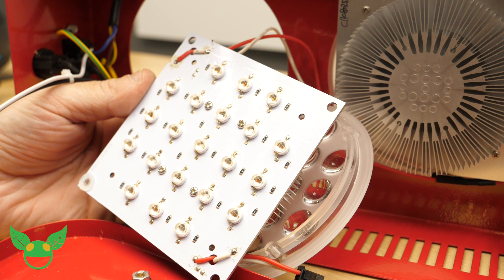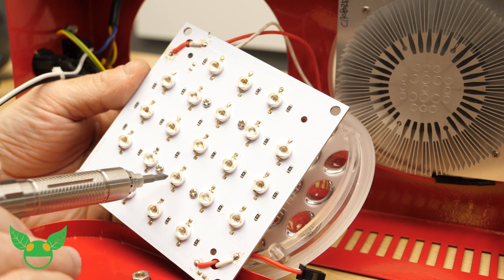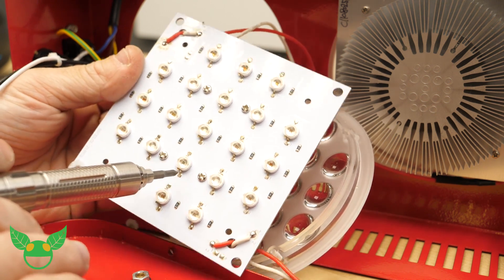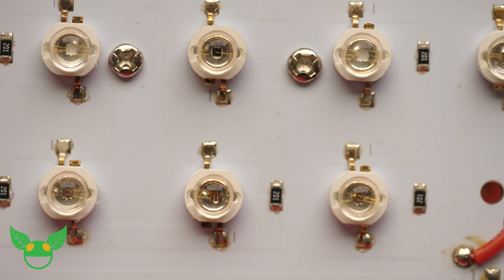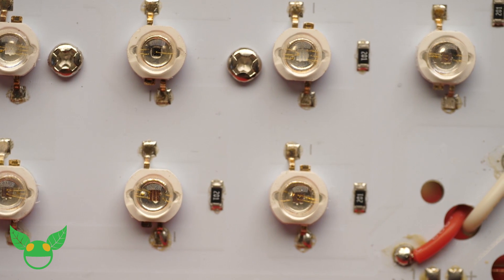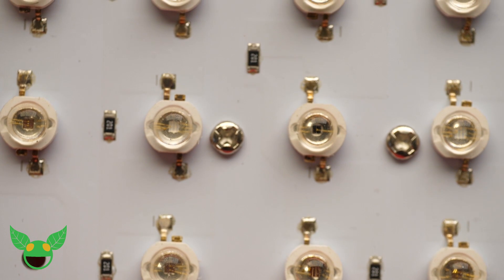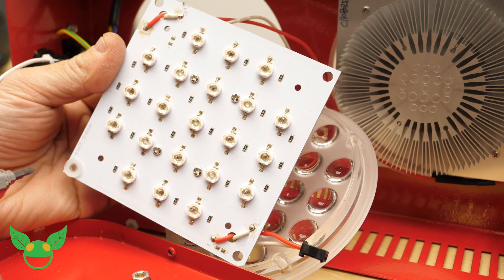As well as other people that have run this technology in lighting laboratories and integrating spheres — 1.4 micromoles per joule is about equivalent to a single-ended 1,000-watt HPS. So you're not necessarily much more efficient than an HPS with this technology, but it does lack the IR or infrared light associated with HPS or HID light sources. Despite that, you can see here that there are some infrared diodes in this light — it's basically like a black dye at the center. It's got a green diode in the center, the clear ones are typically royal blue, and then it's got some reds — looks like some 660nm, possibly some 630nm. So this is kind of a multi-band LED, not full spectrum — it's spikes of specific monochromatic spectra tied together to try to fill the entire spectrum.